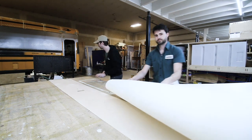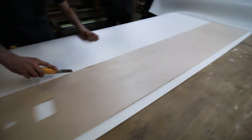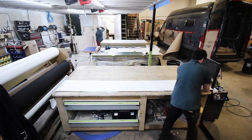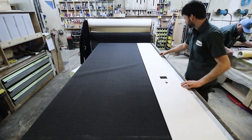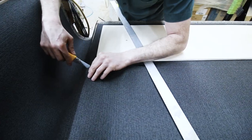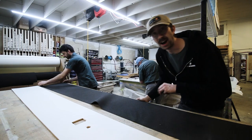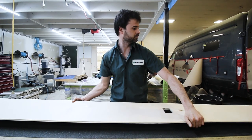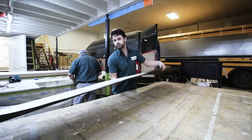First is an 1/8-inch piece of foam. Okay, so next step. All right, so step two after the foam's installed. Well, now it's time for fabric. Then that's really it. There is a step three. That would be applying your fabric and then stapling it to the back. We're still gonna count this as step three, but make sure you add glue to your edges when you fold it over.